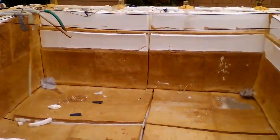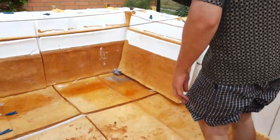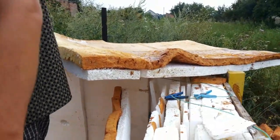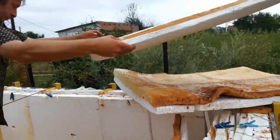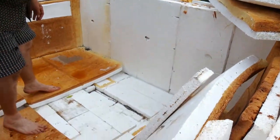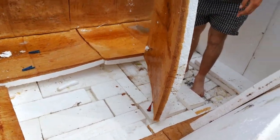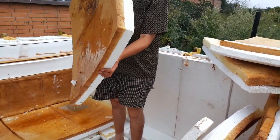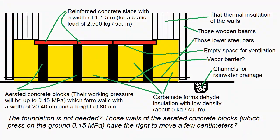Here we can see polystyrene from a storage that was operated at water temperatures up to 100 degrees Celsius. Typically, expanded polystyrene has a long lifespan if summer heating of the storage is less than 80 degrees Celsius. If higher temperatures are planned, the inner layers of thermal insulation must be made of a more heat-resistant material such as polyurethane — though the wrong brand of polyurethane will deform and turn brown due to high temperature. If the summer heating temperature exceeds 80 or 90 degrees Celsius, another material for the floats is also needed, and concrete requires expert advice on the working temperature of its brand.